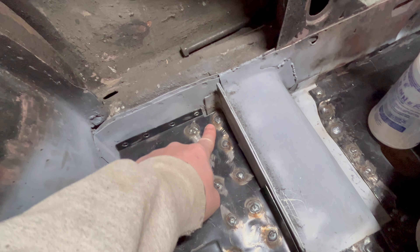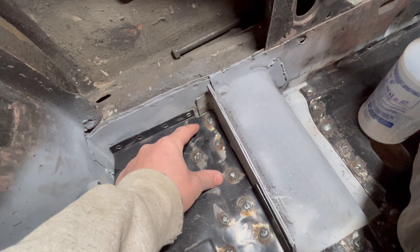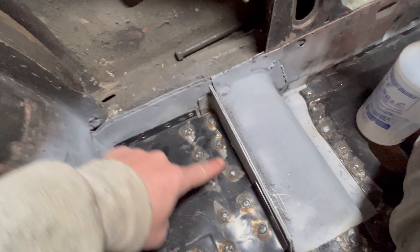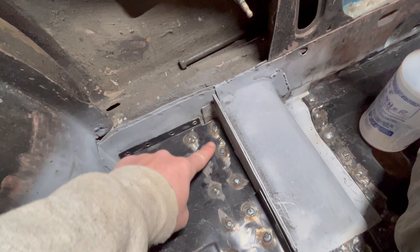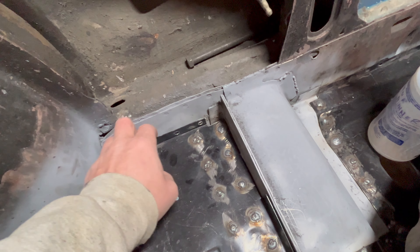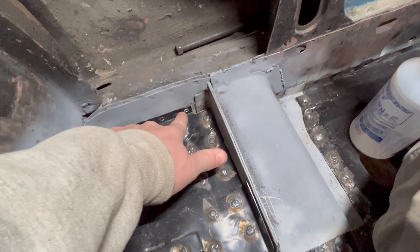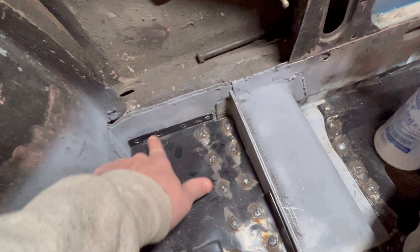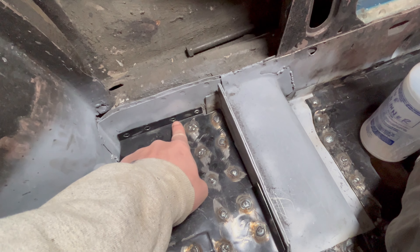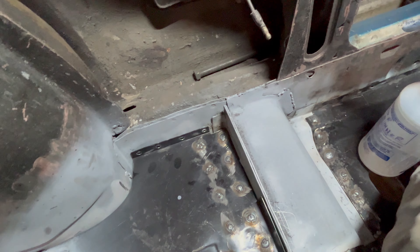This is not structural. It's already welded to the front of the leaf spring mount - where the front shackle would be, if you will. The front leaf spring has a big structure here that's connecting everything together. This is not super structural - it's just to close up this gap and add one more piece of connection. I might put something up where I can and just hammer it over and weld it up. Not critical.